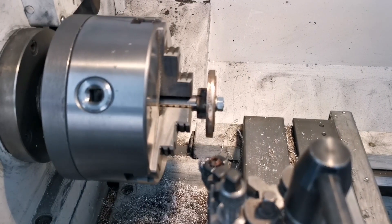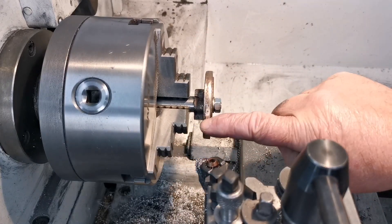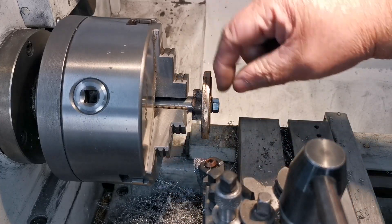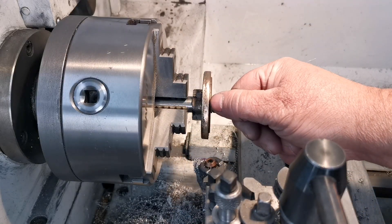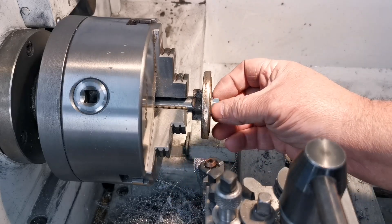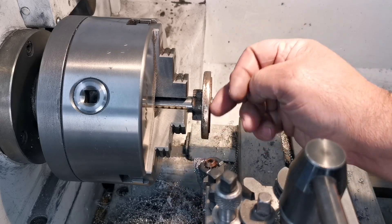As you can see, I've made an arbor and I've mounted one of the caps on there, ready. I'll machine that to the right size diameter, then machine it to the right thickness, then face off the step inside there as much as I can. Then later on I'll mount that in the milling machine and take the middle bit off.